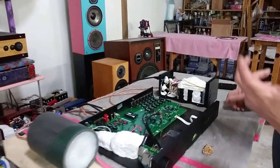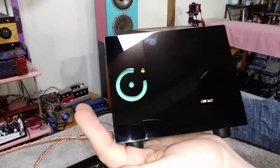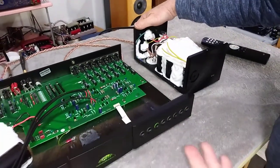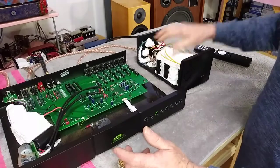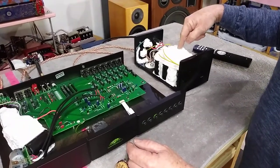We've got a main power supply that's been built for Naim Audio — it's a new Naim GN3A3. So this main power supply would be like when you bought a super cap or a high cap. A high cap has a power supply that runs 30,000 microfarads; this is 330,000. So it is almost 11 times larger than a high cap.